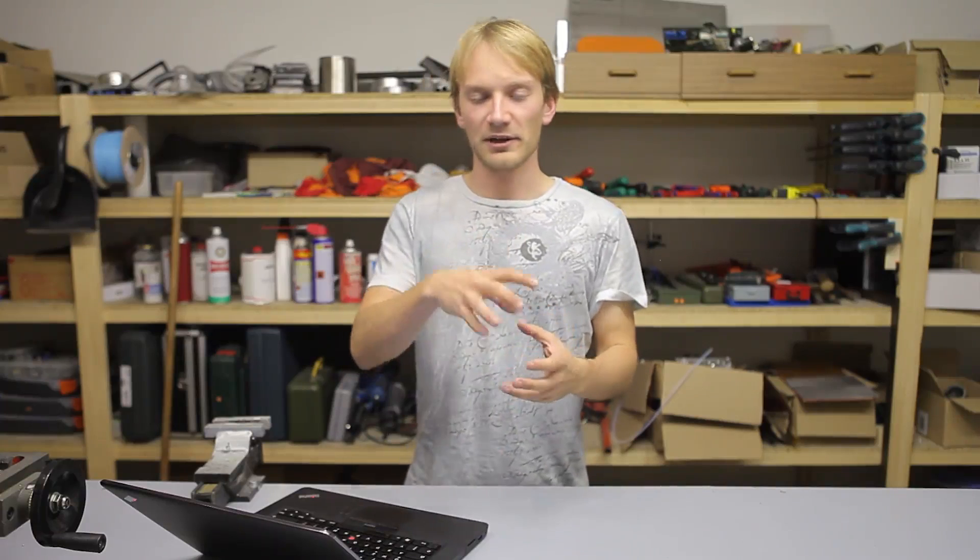The first printer I built, a Sells Mendel, used T5 belts, 5mm wide, and there wasn't much of an issue with that either. So whichever belt you can realistically get in decent quality — these days that is GT2 2M, a 2mm GT2 profile, 6mm wide. That is the standard belt and it usually works really, really well, unless you are running a very heavy printer, like a super heavy heated bed or a direct-drive extruder with multiple stepper motors. A decent GT2 belt is what I'd recommend, that's what I'd say you should go for.